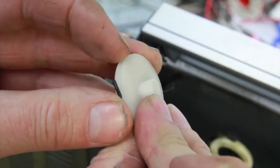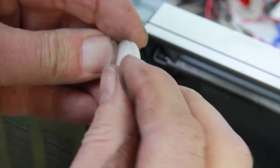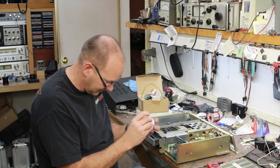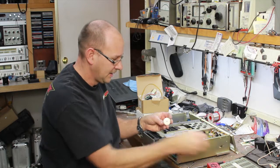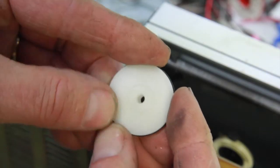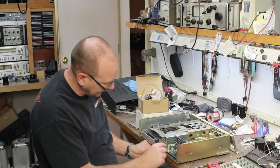You can see how the O-ring's cracked and missing. When rolling, it clunks as it goes along — all this does is act as a rubber tire for it to slide on. So I'm going to take this O-ring off; it's dry-rotted. Then put the new O-ring on, inspect the pulley, make sure it's clean, and install it in reverse order.